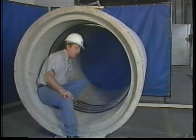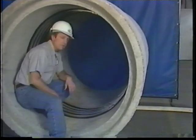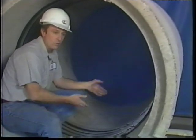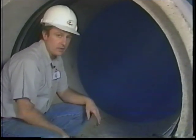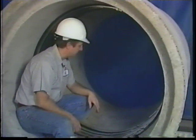As you can see, once we've ganged two of these together, one of our 10-inch seals and one of our 7.5-inch seals, we've created an effective sealing area of almost 1.5 feet. We could have extended even further down with the 7.5-inch seals with flaps indefinitely. We could have gone 21 inches all the way out to the end of the pipe if we needed to.